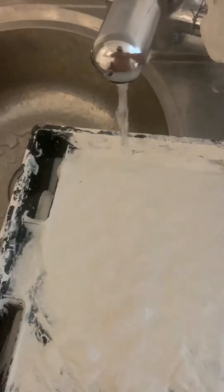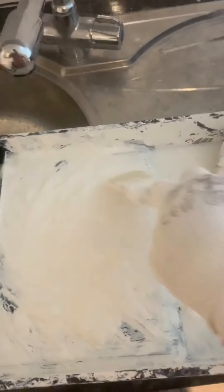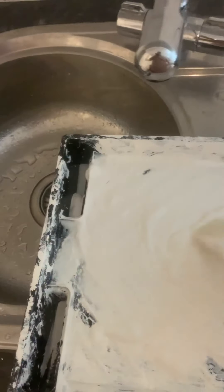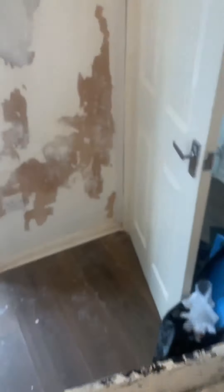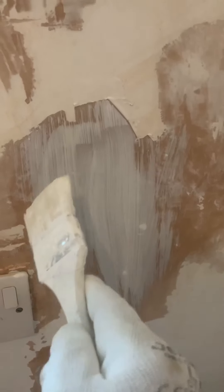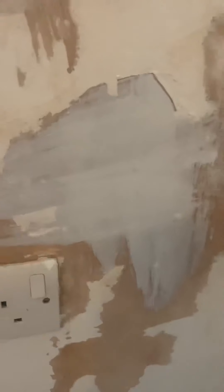I'm adding some water, mixing it — you see — and then just stir it to make it into a milky paint. I've applied it onto the wall where the plaster was. The first coat, you have to do this. Otherwise it's going to come off — if you just apply normal paint it's going to look nasty and bubbly and start peeling off and damaging the plaster. So make sure you mix the first coat with water and apply it onto the plaster like this. Let it set for about half an hour.